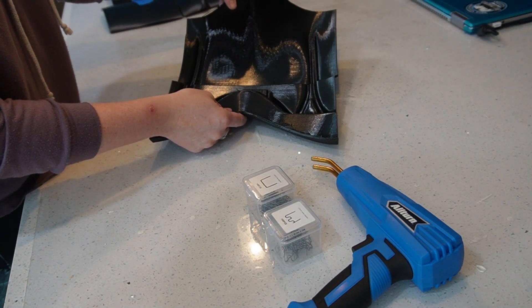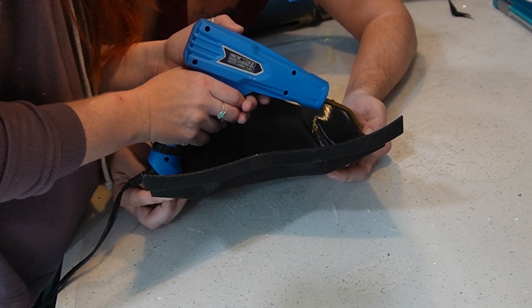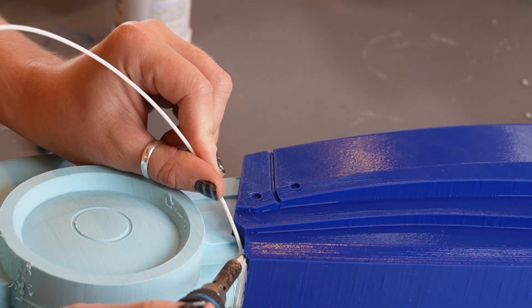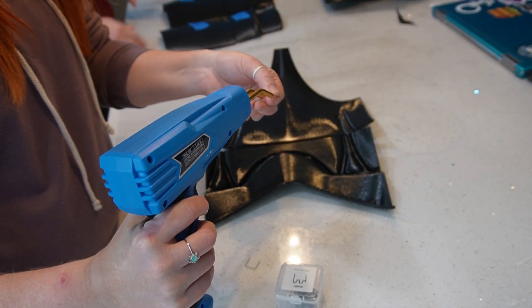Based off of what I learned, we're going to go again and work on his shorts. I'll be using the all-turn plastic welder that I got off of Amazon. The first piece I'm using it on is printed with 3D Print Life's Biopet G, but I'll also be showing you using it on PLA+. I only mention the materials here because for each I'm going to be heating up the machine for just a little bit different times.